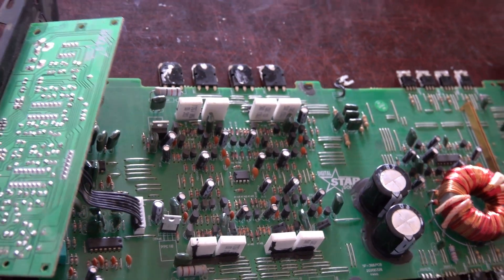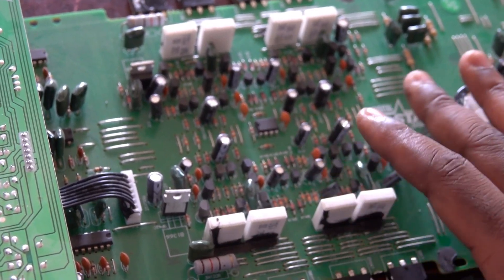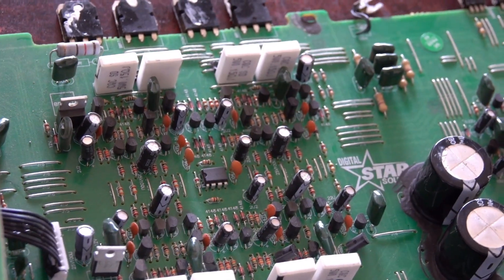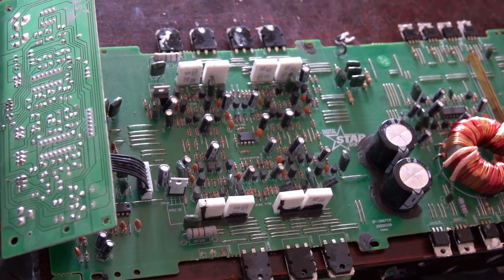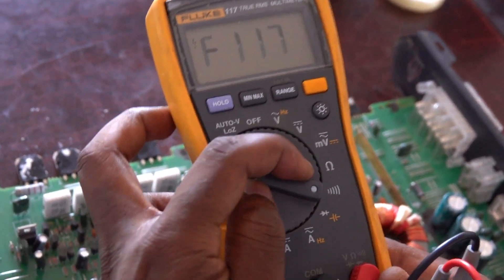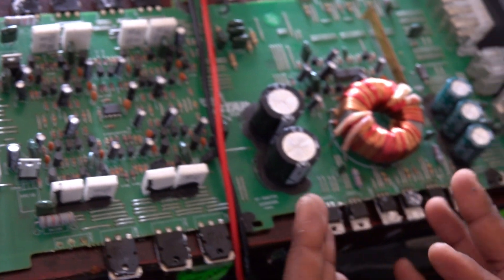The first thing you want to do in a visual check is look for any burnt surface or anything that looks out of the ordinary - looks black, like there was too much voltage or too much current. After the visual check, since I don't see any obvious problem, I'll go to the manual checks with the multimeter. Set your multimeter to diode mode and then check the MOSFETs and the transistors.